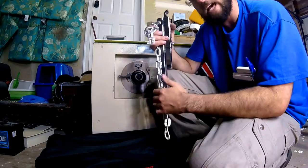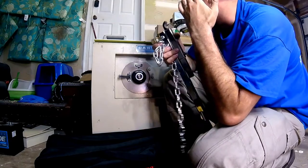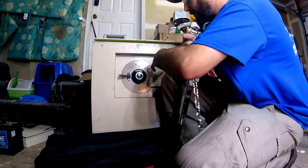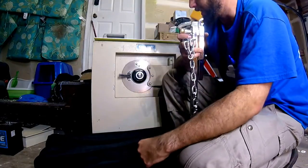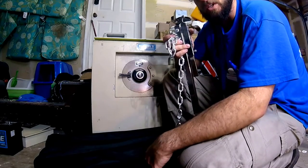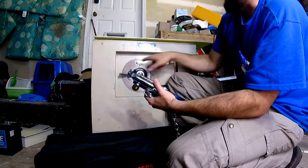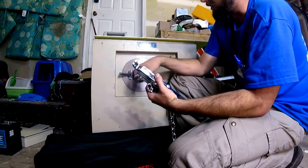One of the things that this does have an advantage of over conventional stationary rigs or a mag drill is that you can angle drill with this. When you're angle drilling, you can actually pierce the case and come in at an angle and not have to remove the dial and cause more damage. So it does offer a few more options that those stationary rigs don't offer — they're just going to drill straight. If you just want to drill straight, those are great for that, but you do have to remove the dial, whereas this one you can drill outside and it's a little more forgiving. You can drill anywhere you want to drill; you don't have to be limited to just where the screw holes are.